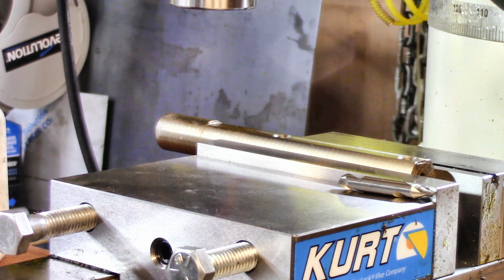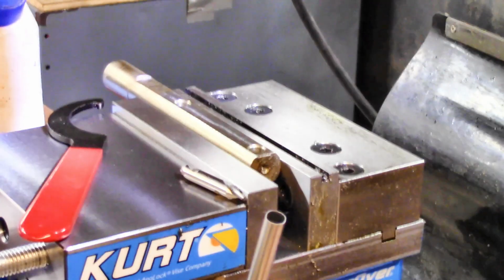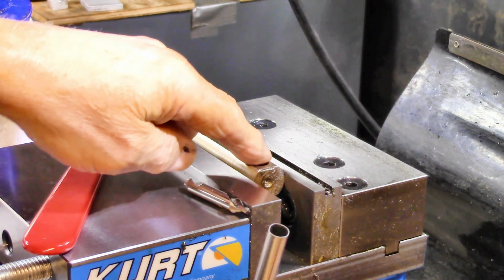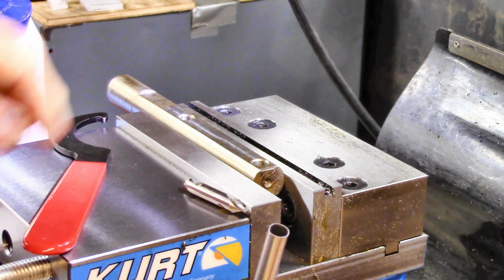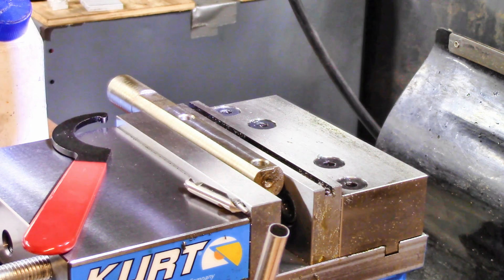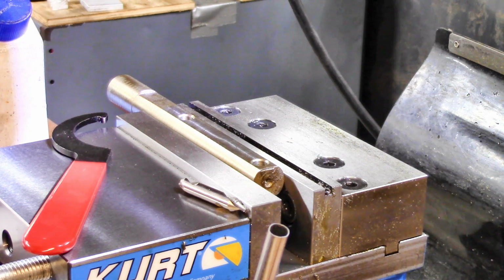So I said I was going to get a chuck and I'm still going to get a chuck. Hang on, I had to reposition things a little bit there, but now I do have a drill chucked in there. This hole is actually a metric size, I think, but I'm going to have to drill it out to half inch to fit these guys back here in the bay on the vise. And then I'm going to have to move down to this next one and drill a completely fresh hole. So what we'll do is load up a half inch drill bit. I need to turn on the DRO here. We need it for positioning.